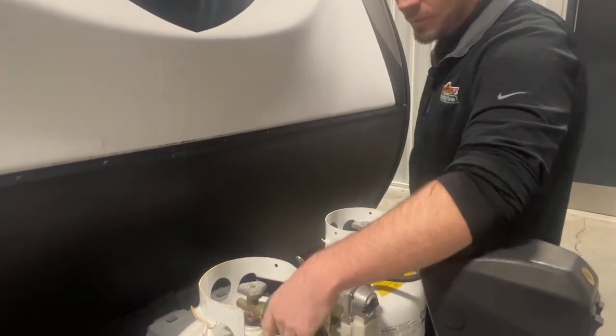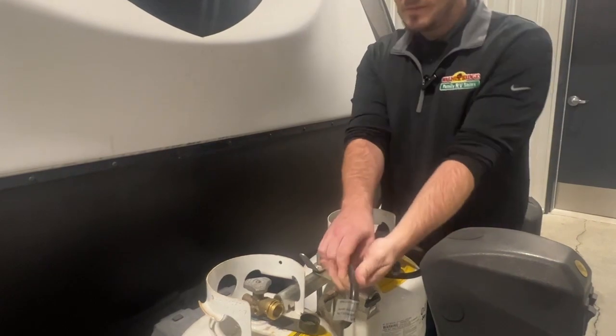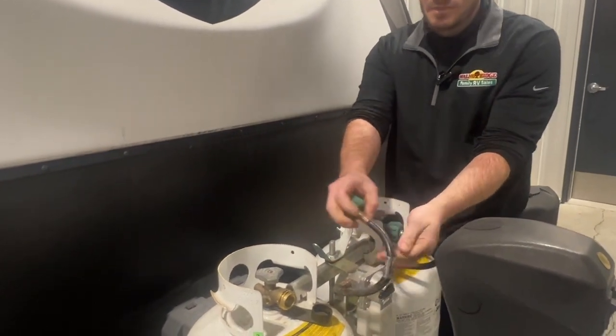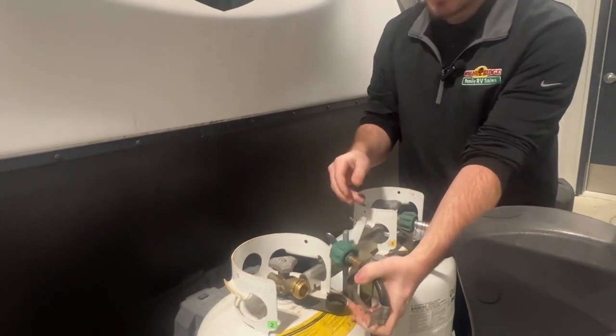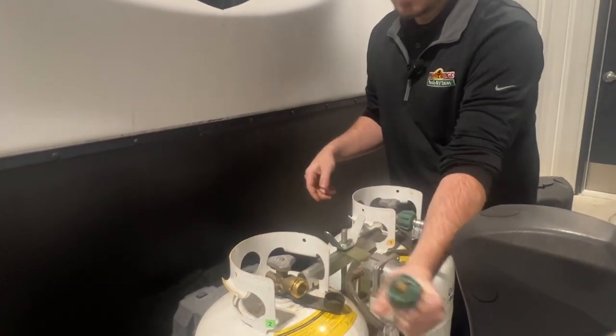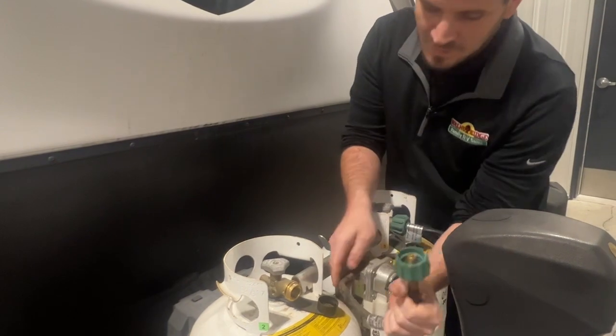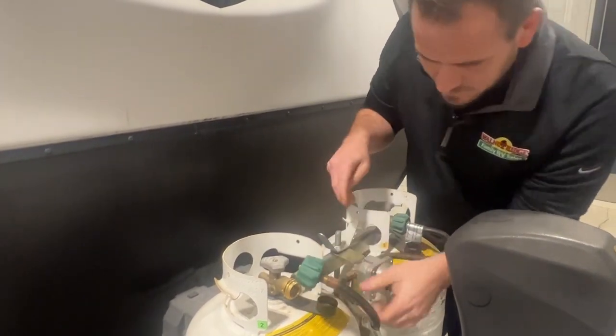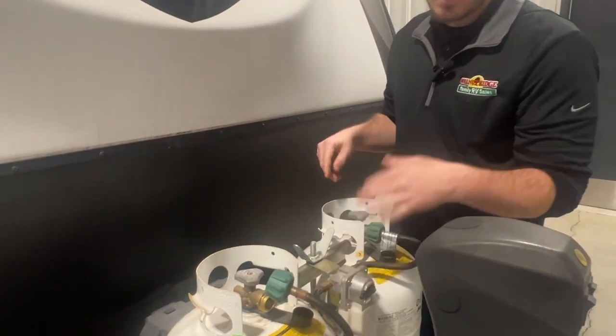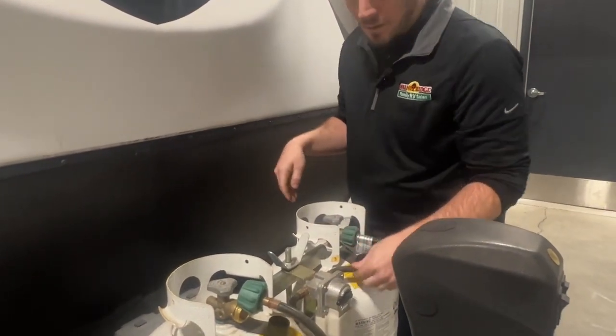If I take this LP hose off, you can't really see, but you can see me struggling with it, very stiff. This should be fairly flimsy. I mean, it's just a rubber hose. And as stiff as that is, if this was cleaned up, I'm sure it's hard to tell. You aren't going to be able to tell on camera. You'll start seeing light dry rotting, cracking.